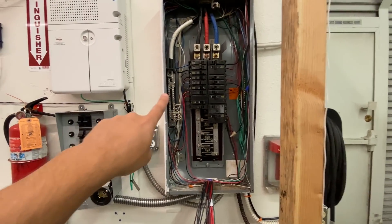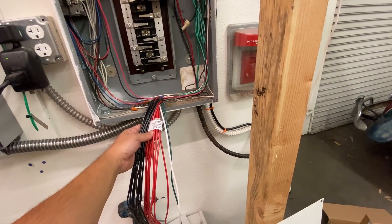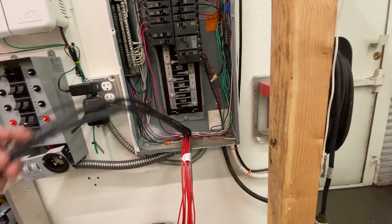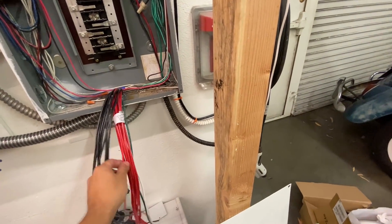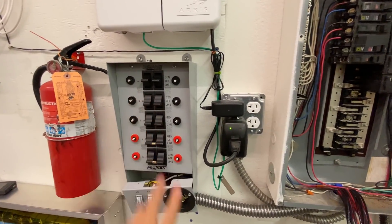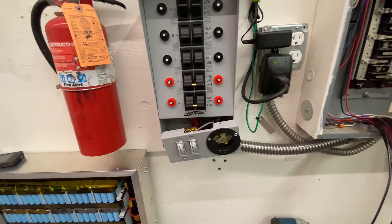That's why I'm not done — I had to spend a whole day just tracing all the circuits, fixing them, removing unneeded breakers, and isolating the critical circuits I want on when the power goes out. Here's the thing: these are the cables feeding all those circuits. This device goes in between. The red leads go to the branch circuit breakers, so I take the cable for the circuit I want, pull it out, put it in here, and the labels — they have an 'A' — come to one of these switches.